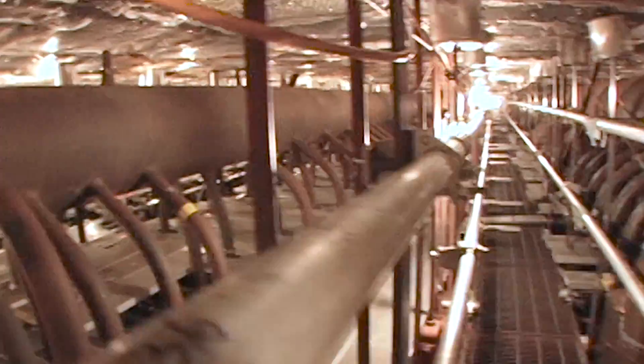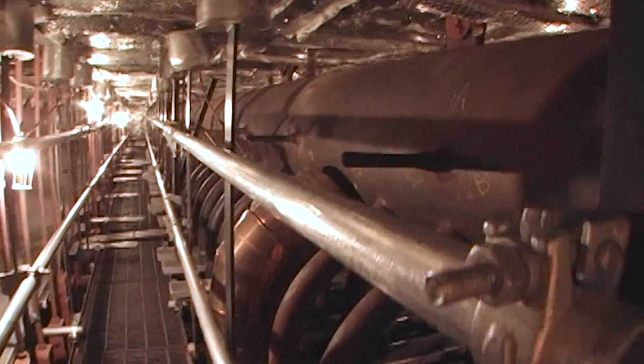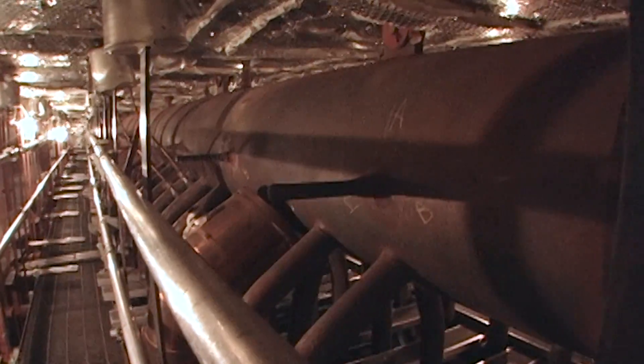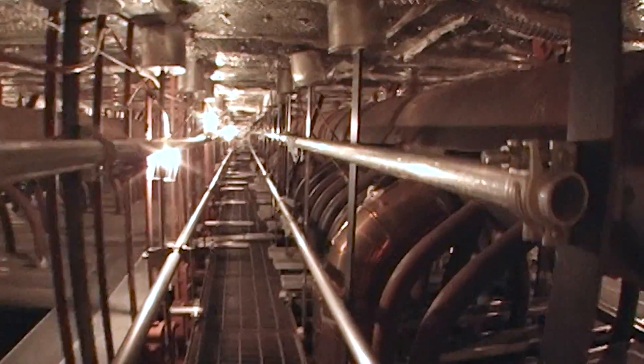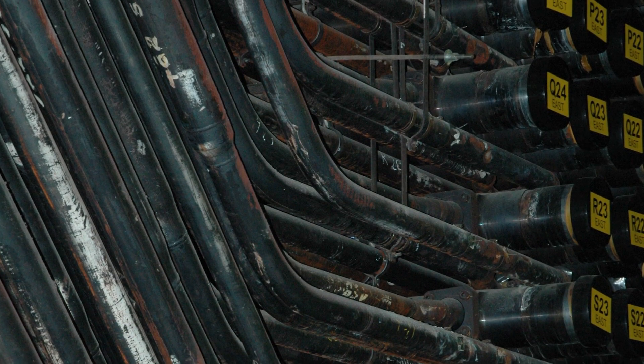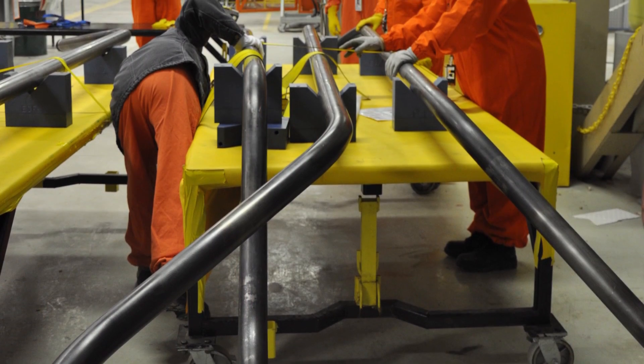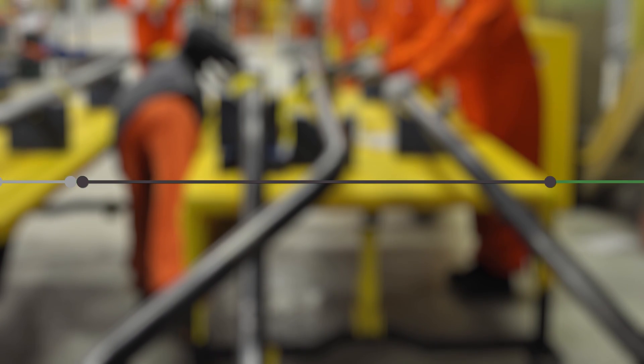Once we go into field installation, we're going to be working in parallel with D-tube-Retube. We're going to be installing upper feeders in the upper feeder cabinet, separated by a platform, while D-tube-Retube will be working below us with the D-tubing and retubing of the reactor. Following D-tubing and retubing, we will install the lower feeders, followed by installation of the feeder cabinets, which completes our critical path scope work.